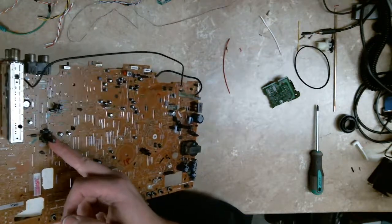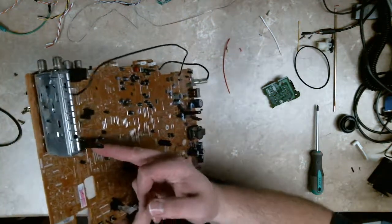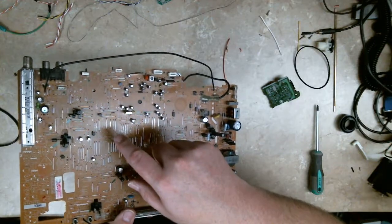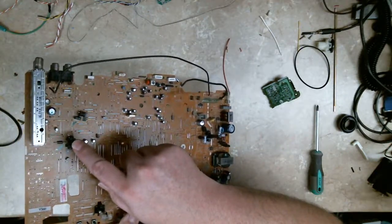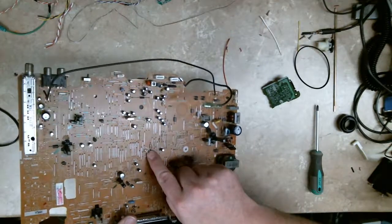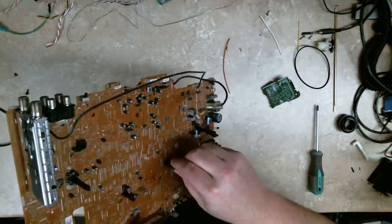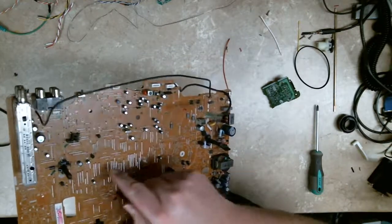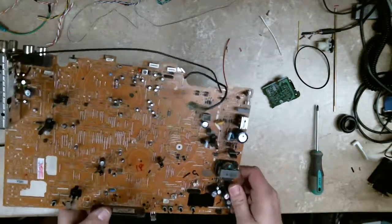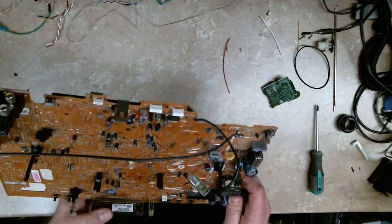And this one is the most critical part of the VCR. Absolutely the most critical safety feature of the VCR. Because if this little guy malfunctions, when you reach the end of the tape, the only way for it to know that it's the end of the tape is the sensor. So if this sensor fails, and believe me, it happened a lot, or this LED, or actually they used to use light bulbs. Ugh, you could look inside and see a light bulb back in the 70s and 80s on the VTRs and early VCRs. So one of these two devices would fail, and it would just wind the tape up and shred the tape because it couldn't tell it was the end of the tape. Very common problem up into the mid-80s or so.